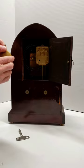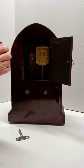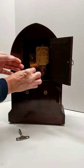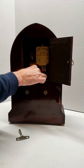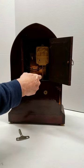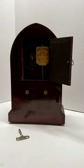You accomplish that by turning the nut to either raise or lower it a little bit — small increments at a time, half a turn, one turn, that's about it. Then rehang the pendulum, restart it with just a little gentle push, reset the clock to the correct time, and see what the trend is over a day or two. Then do it again if you need to until you get it right on the button.